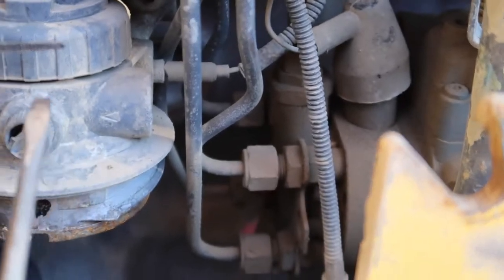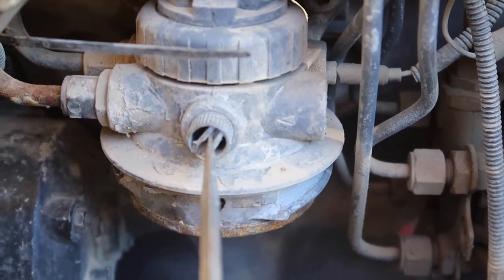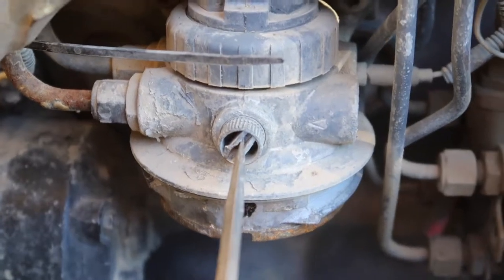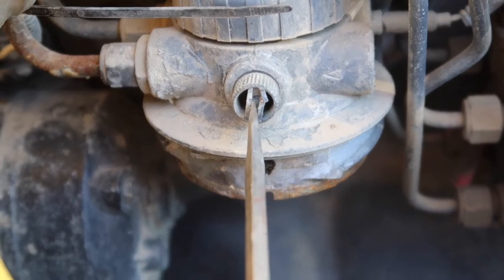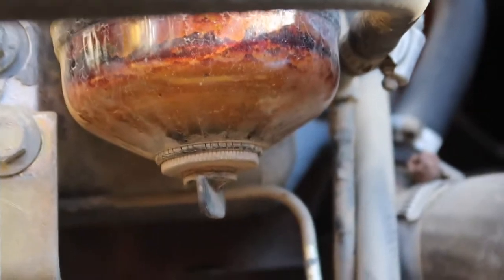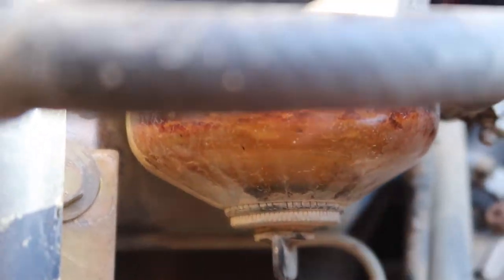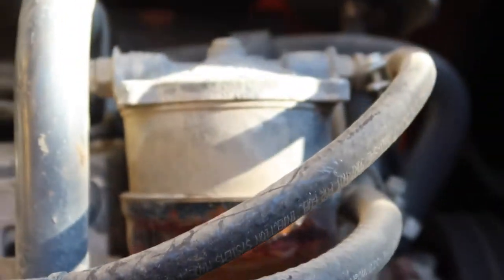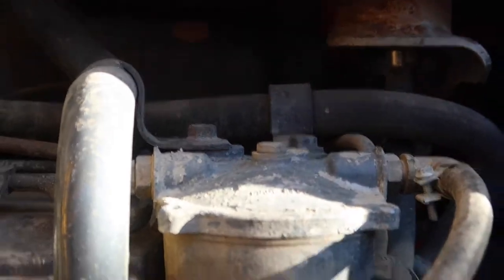While I'm here, I'll try to crack this bleeder because we'll need to bleed it out eventually. And then there's this fuel bowl under here. Basically it looks like you take this tab off right here, spin that out and that fuel bowl should just drop down. Looks like there's a bleeder on top for that.